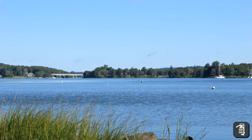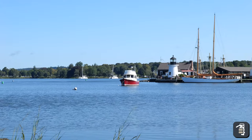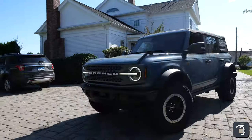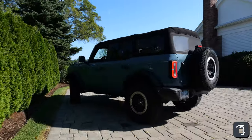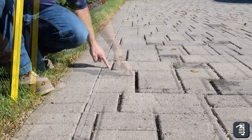This is actually permeable, given the location we're at with the waterways and whatnot. What's your concern? You have one disappointing part of it. So the driveway only accommodates three or four cars. You get three or four cars in and people have to do multiple turns and ultimately end up driving off the edge of the pavement, and subsequently the pavers end up opening up the joints a little bit, rolling — what I call failing.